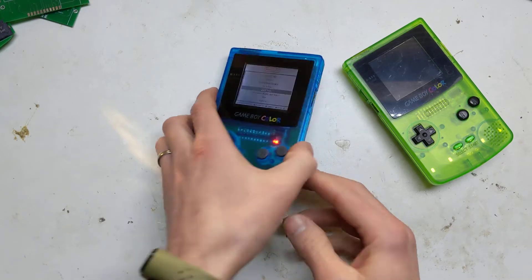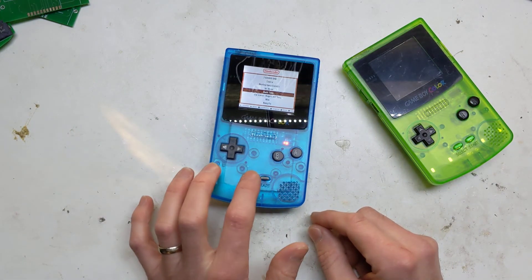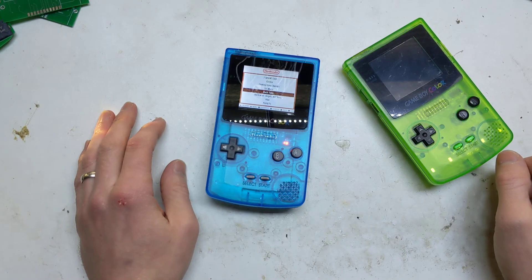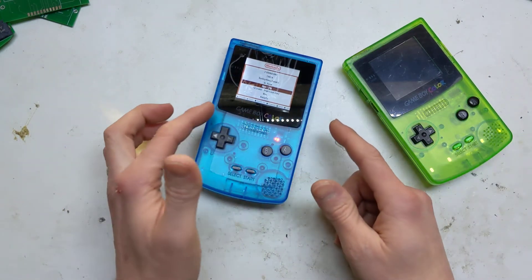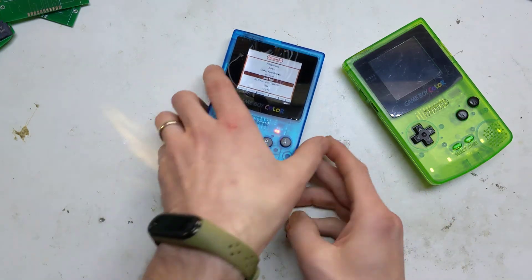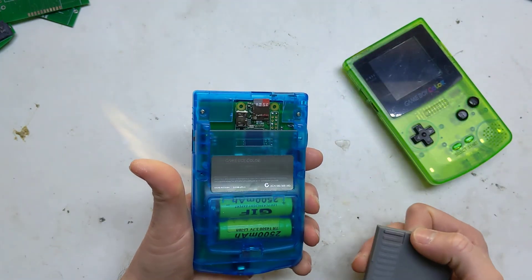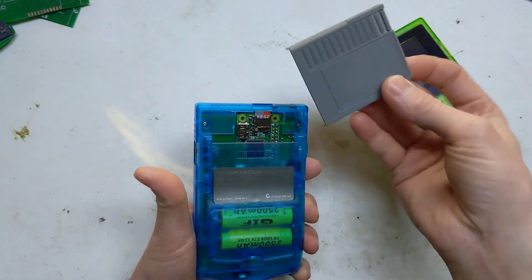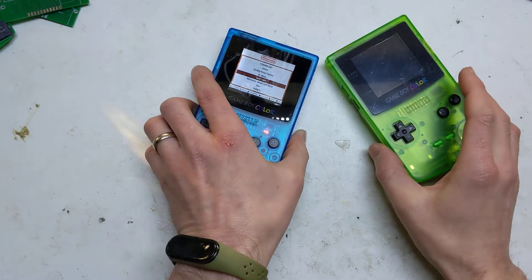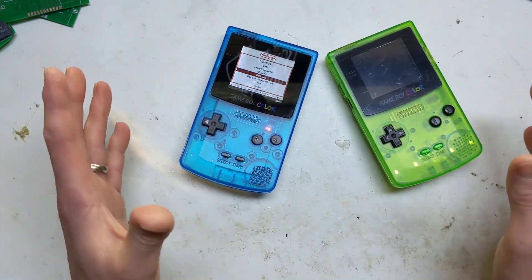The only things you really need to 3D print are these two buttons and the back cover — but honestly, the back cover you could engineer yourself. The buttons might be a bit finicky since they sit on the domes, but you could probably work something out. Some of the case trimming isn't that bad with this one — you just need to cut the sides for the screen, a gap for the power button, some space for the headphone jack, and obviously a gap for the Raspberry Pi. You could make this yourself out of a game case — just cut the back out of one. Link in the description with all the files and blog posts. Thanks for watching, bye!